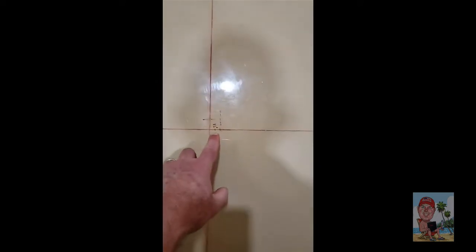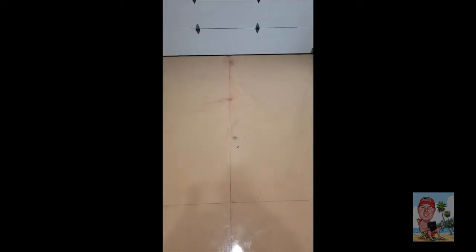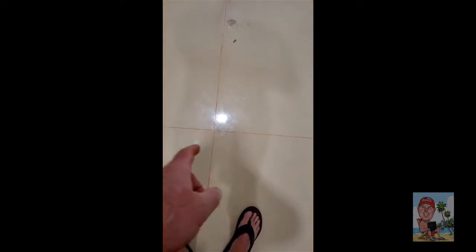Now, I will tell you this, not to confuse you, but just in case you're wondering. If you see on here, I have a mark that's 3/4 inches off, because I estimated that my line actually wasn't straight. The way I had to make the arcs, I had to have my son hold the tape measure, and it gets off a little bit. So I determined that the actual center was in between the actual snapped mark and the 3/4 off mark. And so when I split the difference of the 3/4, which was 6/8, I went to 3/8.